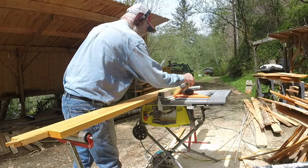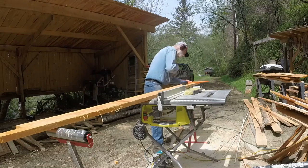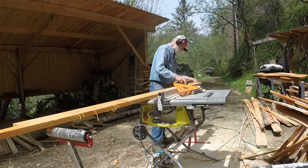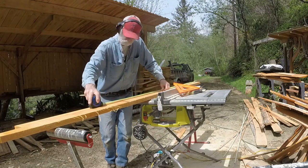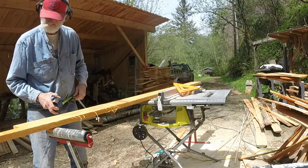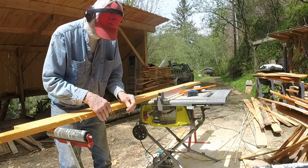All the boards are slightly longer than necessary, and the ends are not square, so I have to trim both ends for square and for length. Each board is 100 inches long. Except for a few 8-footers: I forgot my measurement after taking a few days off from the project and cut several at 8 feet. All those woody strings are the result of a dull bandsaw blade.